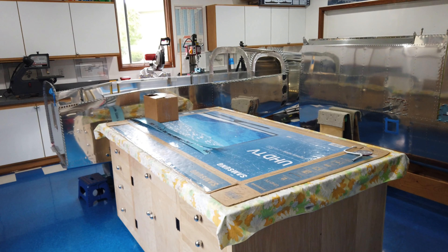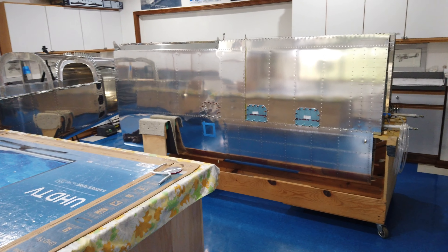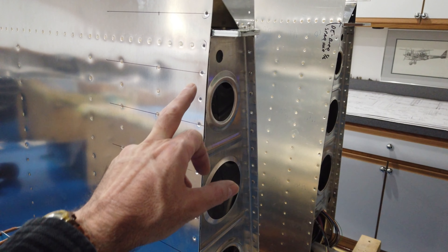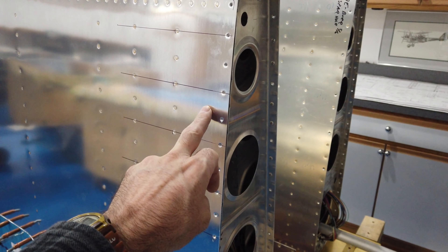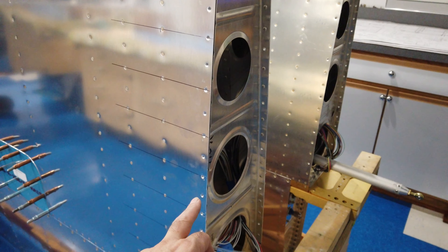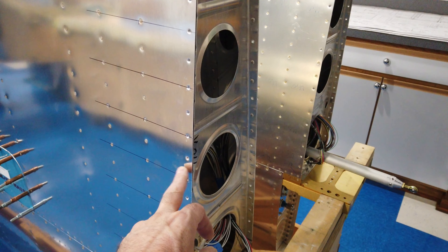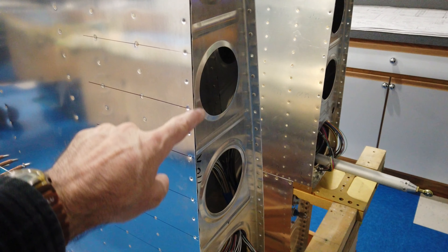Howdy everyone, we are back inside Site A — back in the shop. The arrangement here is basically the same setup I had when I was working on the wing skins. When we had things out in the garage, we had fitted the wing fairings, and there were certain hole locations for the wing fairings — you can see them here with the black lines. These locations need to be opened up for, I believe, a number eight screw, and they need to be dimpled — I have to look at the plans again.